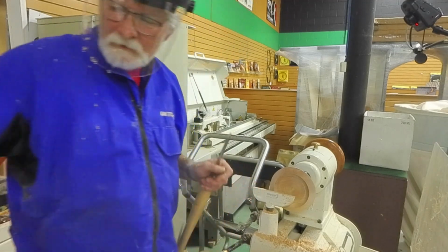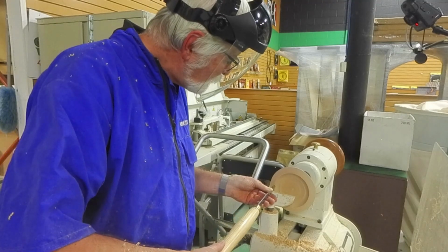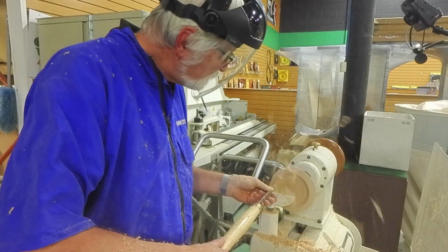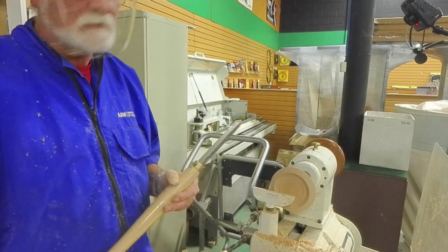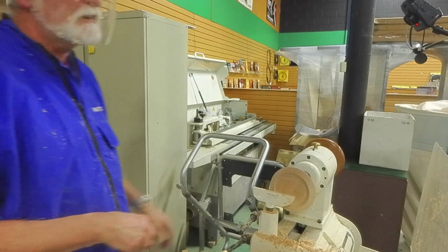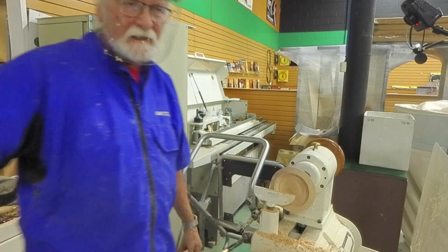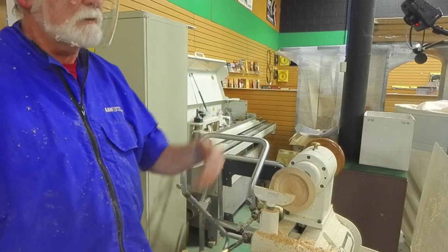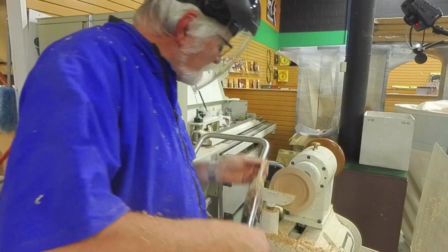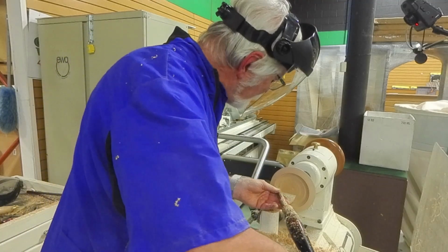Get your parting tool. Set it back a bit. And you want your hole right there. Why can't you do that? Nobody said you couldn't. And I've seen that recommended many, many times by the professional teachers. If you're unsure, or you really, really want it right there, get it started with a parting tool.